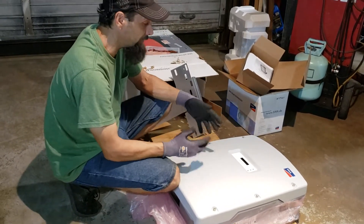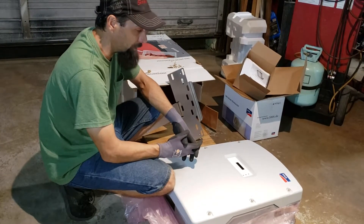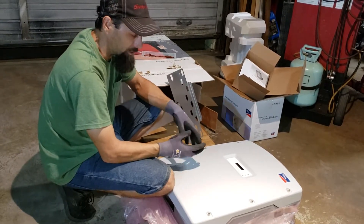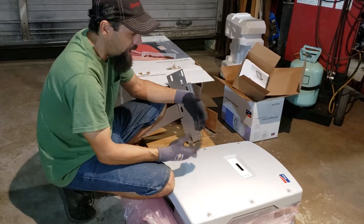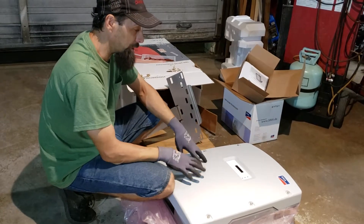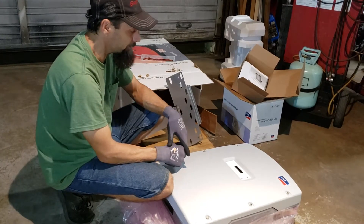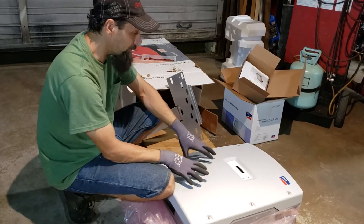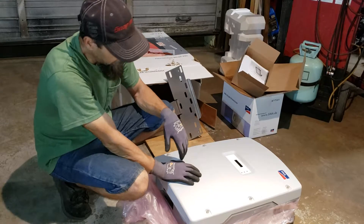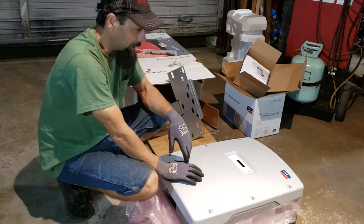Like I said, this is 6,000 watts right here. It's capable of — I think in the schematics it says it can go up to like 6,200 watts. But we're going to be closer to 7,000 watts on the actual roof because of the offset for the summer — you get a lot of loss during the heat. You just don't want to go over for the wintertime, because when it's cool these panels can make a lot of power and you don't want to overwhelm your inverter. Anyway, this is the Sunny Boy. I picked this up on a deal — sometimes you find them on eBay.